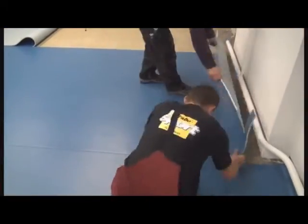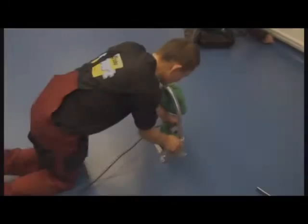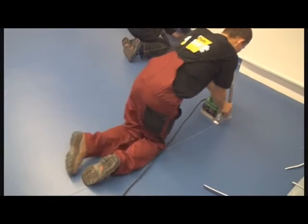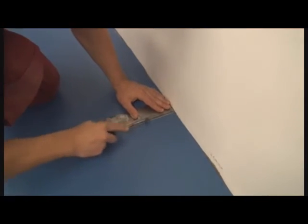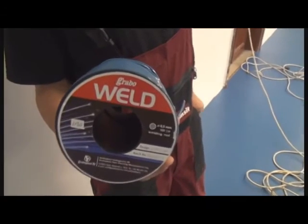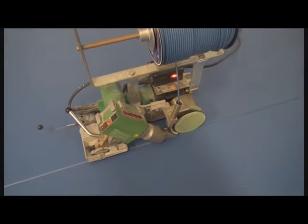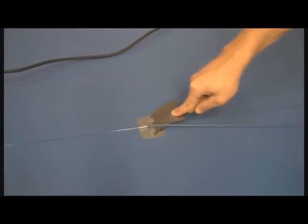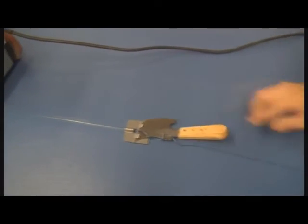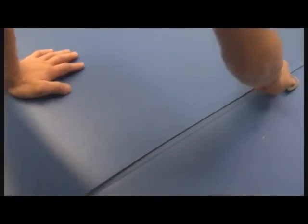After gluing down all the flooring, roll the joints using a 50 to 60 kilogram steel roller. Immediately afterwards, you can start welding the joints. First, the joints should be grooved to the appropriate depth with an automatic grooving machine, and at the edges with a hand grooving machine. The joints should be cleaned from debris. For the hot welding, use a 4.5 mm GraboSport welding cord which is available in a rich color choice. Hot welding can be carried out with the Leister automatic machine, and at the edges use the Leister Triac manual welding tool. After the welding seam has cooled down, remove the excessive welding rod in two steps: first cut off half of the welding rod using a trimming guide and a quarter moon knife, then cut the remaining weld to plain with a quarter moon knife.